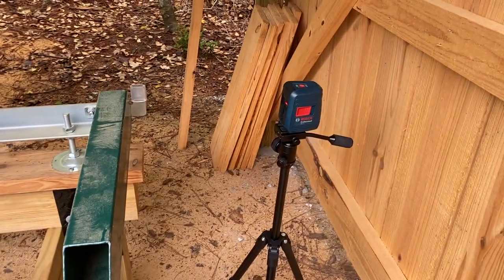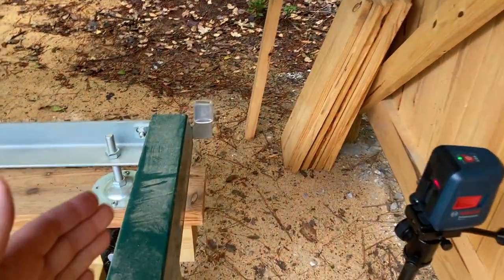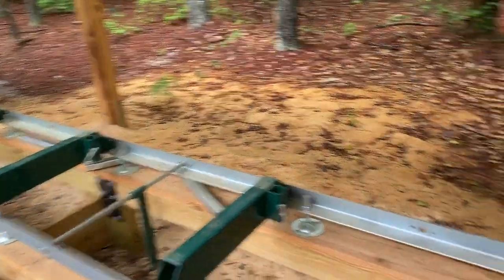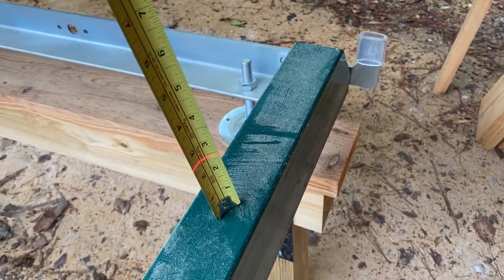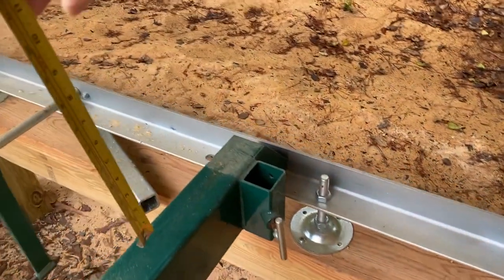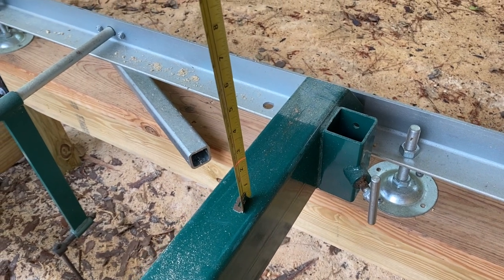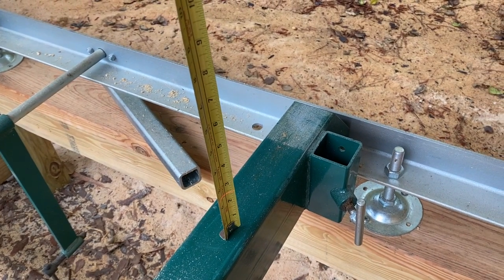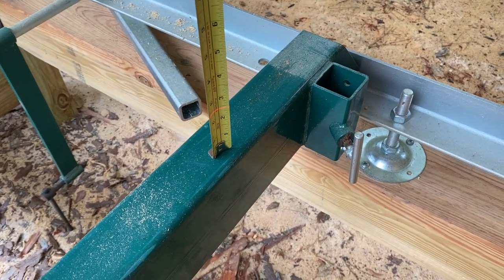Being tipped could affect how the saw head hangs on cables if your mill is set up that way. Level is good, but really the most important thing is flat. When using the laser level, you'll be checking for both. What you want to do is set it up at the end of your track on a tripod — or you could hang it on a nail on the wall of your sawmill shed — and it's going to shine a laser light sheet down the track all the way to the other end. Then just grab a tape measure, put it on your bunks, look for that laser line, and get it set consistently.